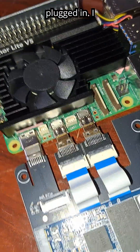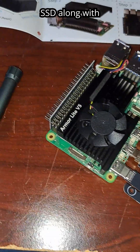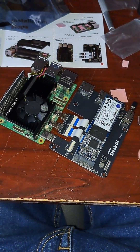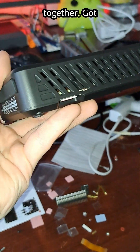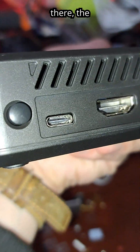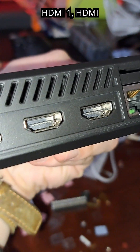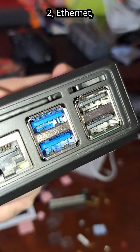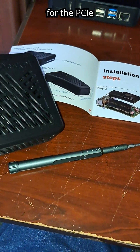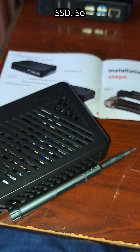I've got the board plugged in, even went ahead and installed the SSD along with the pin header as well. Now I got it all put together. Got the SD card right there, got the GPIO pins right there. The power pin, power button, HDMI 1, HDMI 2, Ethernet, USB 3, USB 2. And I also remembered to put in the ribbon cable for the PCIe slot for the SSD.